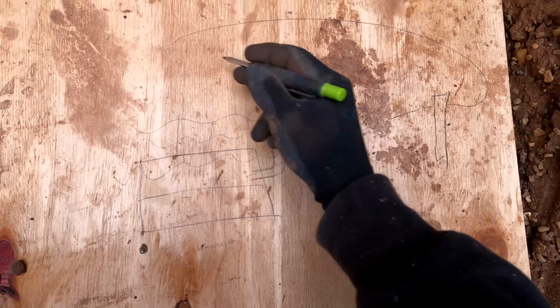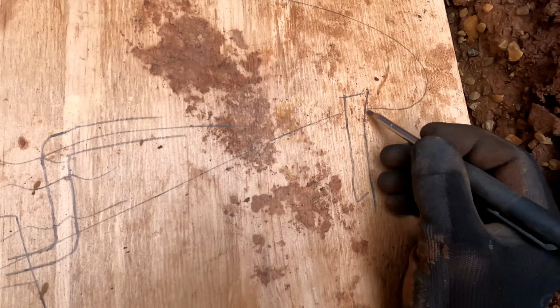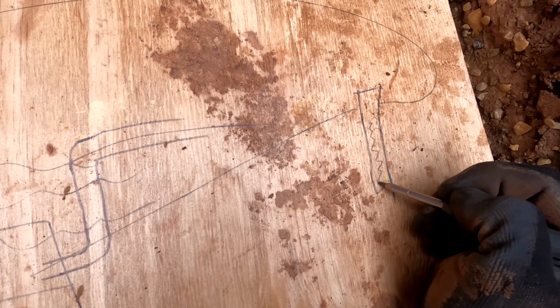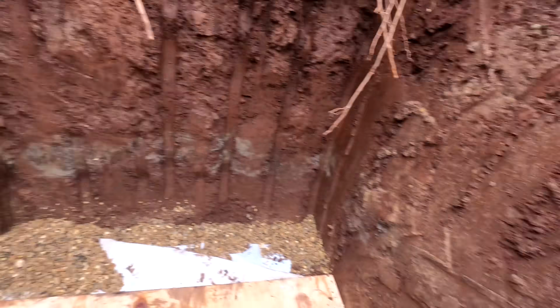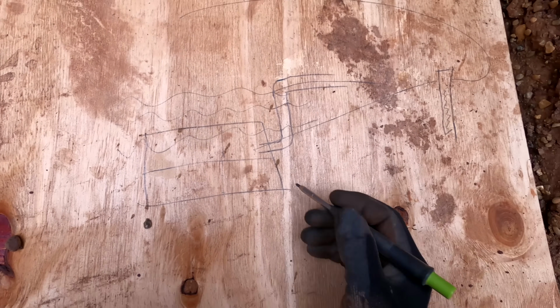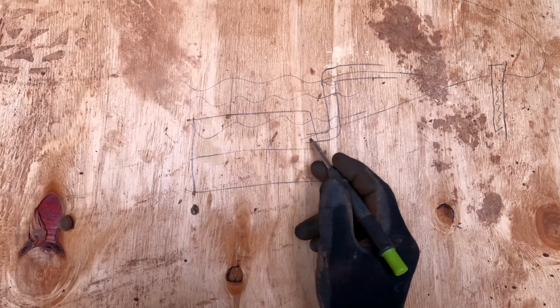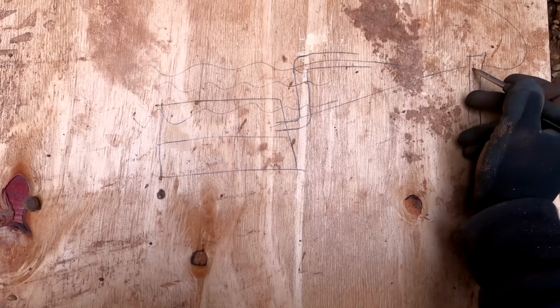So the water will come in from the garden, through the French drain, into our silt trap. Any sediment will come down the bottom here, and then the clean water will run through into this hole that I'm in now. If we just put our 4-inch pipe at a steady gradient like this, as soon as the water fills up in this crate to a certain point, it's just then going to backfill this straight up here back to the silt trap.